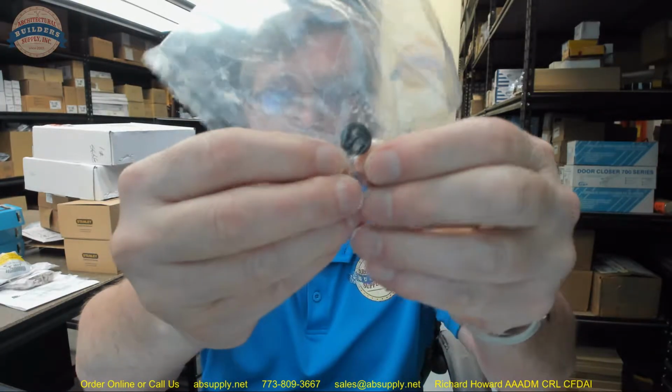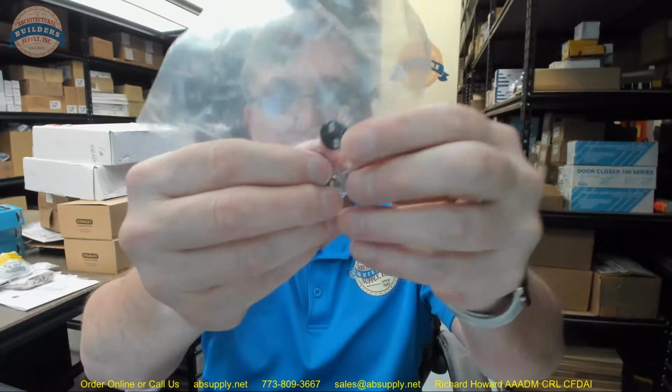Plus, I would think that on the two driving bars that are inside of here, you'll have less micro flex on those two bars when you have that spacer that's forcing the two bars to stay parallel to each other. So if you've got 6-pin cylinders, drop that down in. And you can have a 5-pin cylinder. They do make that. This thickness of that plug's not intended for a 5-pin environment.